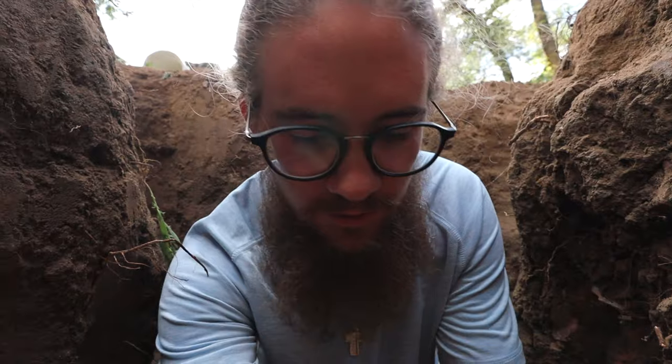So I'm here in this hole, this lovely sewer hole. Got the pipe out, as you guys saw. And now all there is to do is basically clean up the ends of the cast iron to where the flange will go, which is, I have 4-inch flanges. So, well, yeah, 4-inch diameter, but by 4 inches long. And so I need to clean at least 2 inches. Make it nice and clean, because the only thing that's going to be sealing that is the clamping pressure against the rubber. And so the cleaner it is, the better it'll seal.